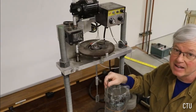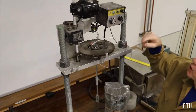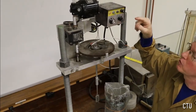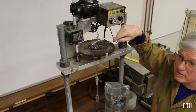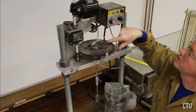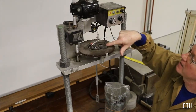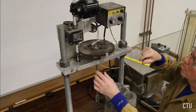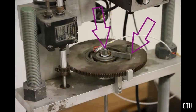Shear stress at any given time. In this lab-based device, the rotation is applied through a variable speed motor which can turn this horizontally geared wheel at different rates depending on what's desired. This rigid block is fixed to that surface, and so as the wheel turns, it moves around and eventually comes into contact with a blade on this horizontal bar.